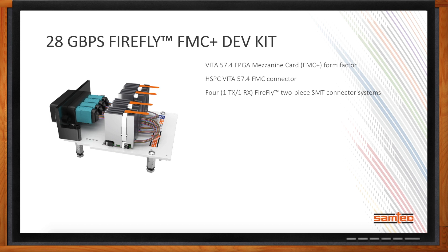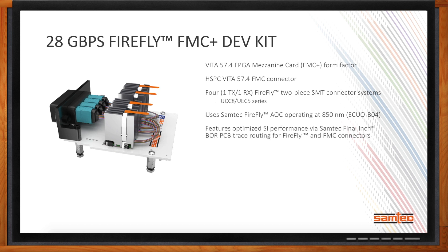This particular kit supports up to 10 high-speed multi-gigabit transceivers operating at 14 gigabit per second, both transmit and receive. The board also features an industry-standard 24-fiber MTP MPO connector for connecting to the outside world. In addition, we are working on a 28 gigabit Firefly FMC Plus development kit, which we should be releasing around mid-second quarter of 2018.